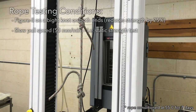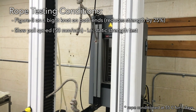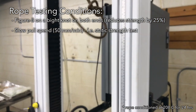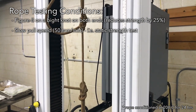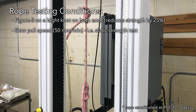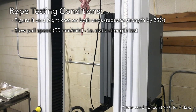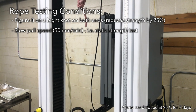As a control I also subjected ropes to ambient temperature water, which is about 20°C, for 7 days. I also took some rope samples and exposed them to even more extreme conditions: 95°C water for 7 days, which is about as hot as you can get water, and dry heat at 200°C for 24 hours, which is just a little below the melting point of nylon.